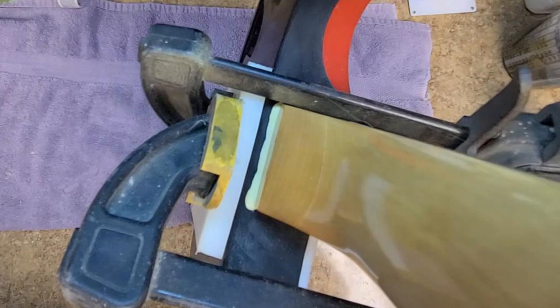If there was a piece of wood or some type of debris inside that pocket and you go to put the neck on it and you clamp it, and then you notice that there is a lot more squeeze out on one side and very little on the other side of that seam, chances are there's something inside there that's stopping you from seating both surfaces together nice and tight. Also, after you clean up that squeeze out, you'll be able to tell if the two surfaces are put together nice and flat with each other just by looking at the seam itself, if there's a little bit of a gap or something. Sometimes you may not even tell because of how tight it is, but you'll be able to tell with the squeeze out that there's a problem someplace.